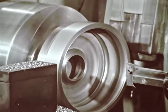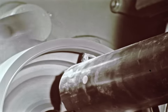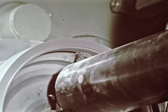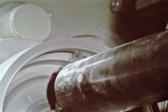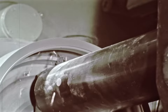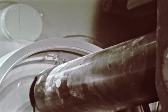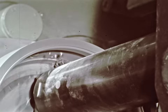Here's a real money saver for the 220 user. Formerly, the most difficult part of this housing was the machining of an inner convex curve. A secondary handling was required for this one operation, adding time-consuming, unproductive transportation of parts, as well as extra loading and unloading. Now it's all done on the Series 220. A standard insert type tool automatically breezes in to rough out the contour.